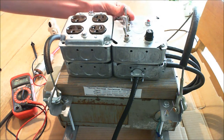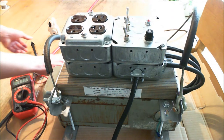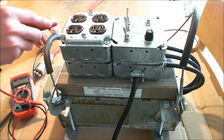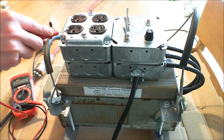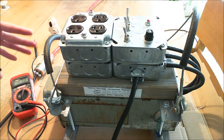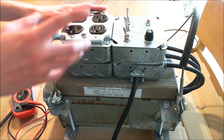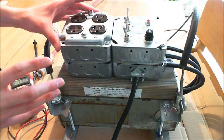So you might want to float your ground. Once you float your ground, I'll do that same pin and connect it here — you look on the meter, no voltage whatsoever. But there's more to it than that. If you're just floating your ground, then why even have the ground pin? Well, there are certain circumstances where you still want the ground pin connected.